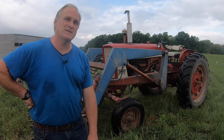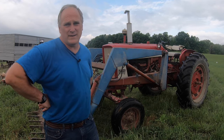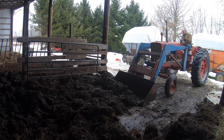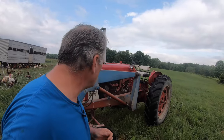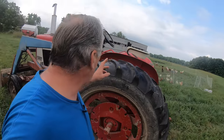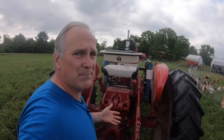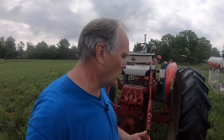This is the tractor that gets used next most often on our farm. It's a 1964 Farmall 504, and until about three years ago it was our biggest tractor and did all the heavy work. Since we bought the larger 656, this tractor has been relegated to loader duty — we put a Ford loader on it and use it to move manure and hay around the farm. A loader is so handy to have. It's got a four-cylinder gas engine, about 45 horsepower, and it has live hydraulics and PTO, which means I can have the clutch depressed and the tractor stopped and the hydraulics still work. Before that advance, whenever you pushed the clutch in you would lose those functions and had to put the tractor in neutral and let the clutch out for them to work again.